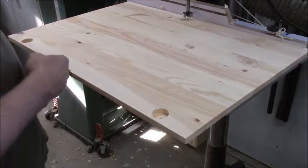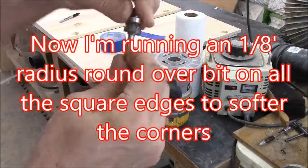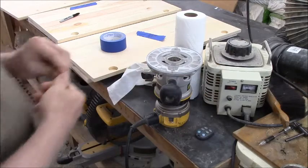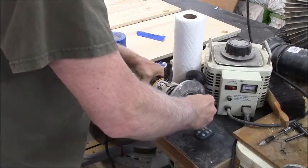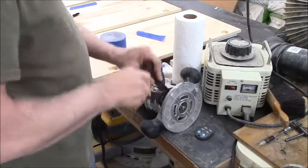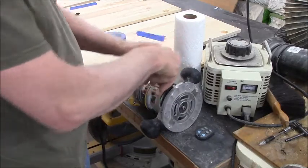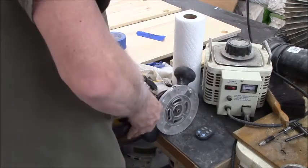I need to run my router around the back. I'm not going to be too particular about that given the warpage, so I'm just going to do that with the hand router. I'm going to mount up this little 1/8-inch roundover. My black wrenches are the DeWalt — I love this router. The depth adjustment is much nicer on this than that old Porter Cable.